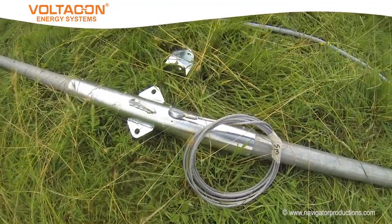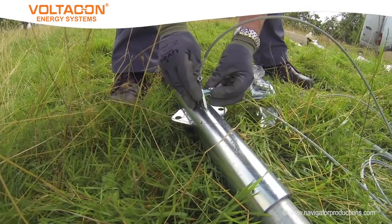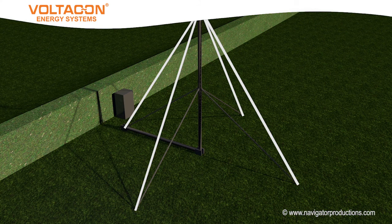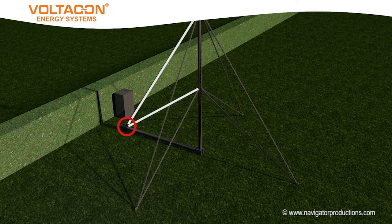When the first two parts of the main pole are assembled, the guy ropes can be attached. There are actually eight guy ropes in total: four connected to the connection between bottom and middle poles, and four to the top of the middle pole. Six of these connect to the guy rope brackets and two to the end of the gin pole.